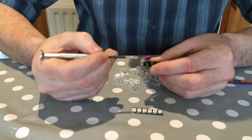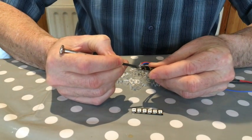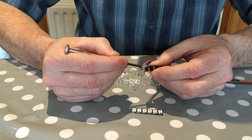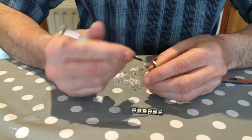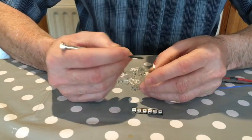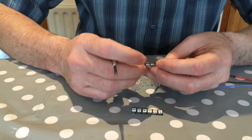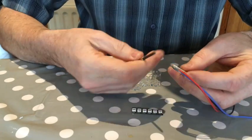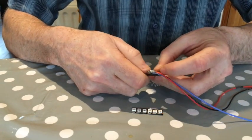There's a little bit of extra hot glue here to prevent the contacts from coming into contact with the PCB traces on the other side, which would cause a short circuit. To bend it, I just take a small screwdriver, place it along the line on the PCB, and bend a little bit at a time.